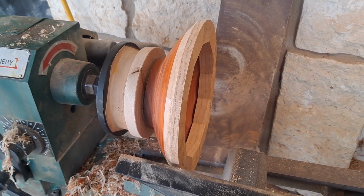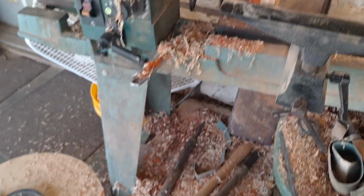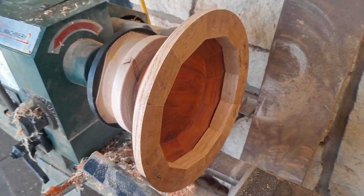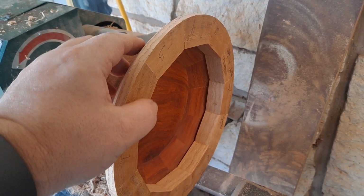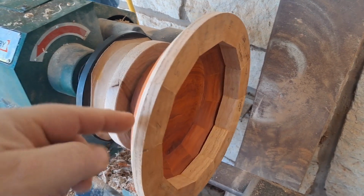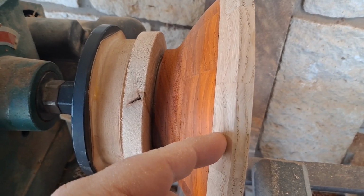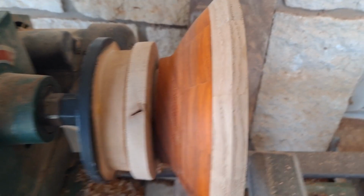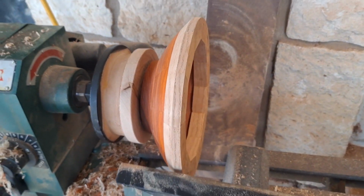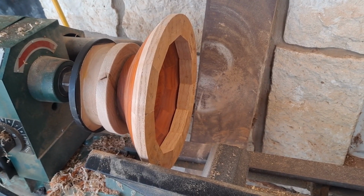Alright, so here's the next video, and this is after I've just got through turning. You can see there's shavings everywhere. I've turned the outside. I've got to true up this top layer right here, sand it flush, and I'm going to actually cut it off about 1/4 to 5/16 and split this ring in order to make the design that I'm going for. Alright, show some more in the next video.